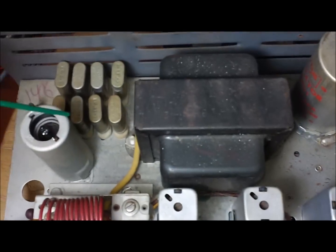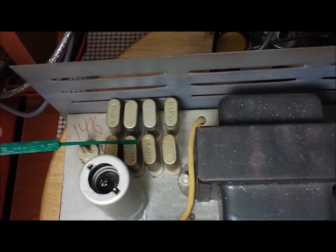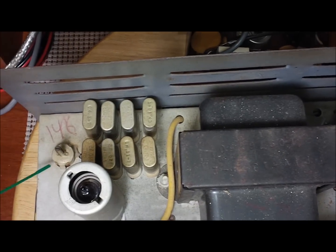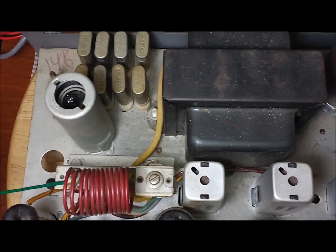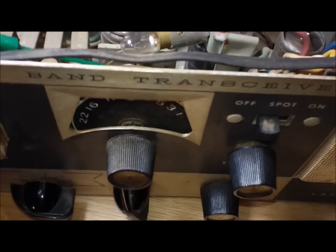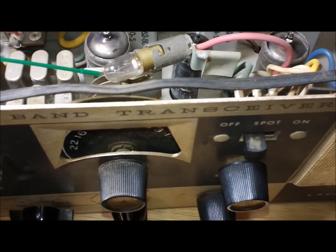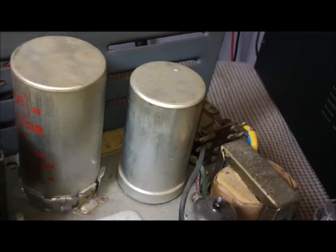Okay, I got the top off. Seeing some of the same stuff here. Transmit crystal side, receive crystal side. Maybe something to do with inspection, that number's scribbled in there. Final output, load and tune, already shown. Here's a variable capacitor for your tunable receive section. I'm having a brain fart, folks. Main power transformer.